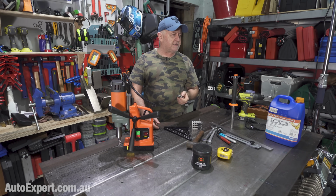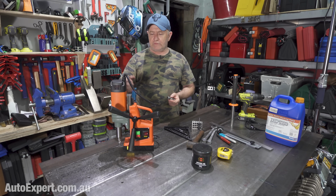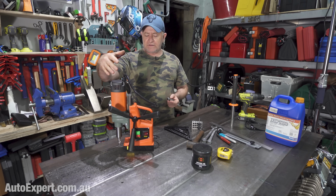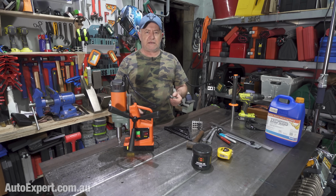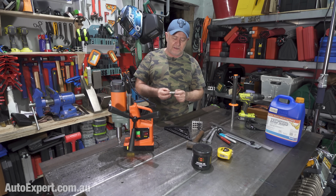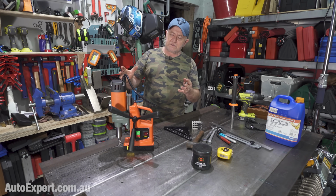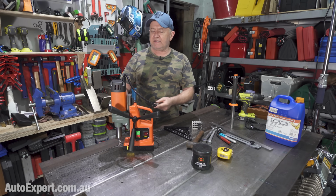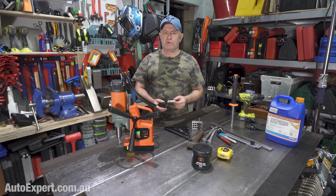The only thing you've got to be careful about is you've got to feed it a bit of coolant. Now, drills of this nature typically come with tanks that you can load up so that they'll drip feed coolant through the shank and through the bit into the cut. That's cool, literally, but I prefer to do it manually because I find the tank a bit cumbersome, and sometimes you're working in an environment where the space is enclosed and it's a pain in the ass to pull it all apart if it doesn't fit. So your squirty bottle full of coolant.